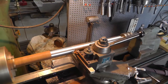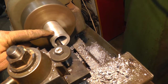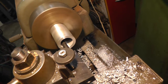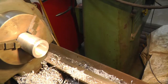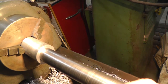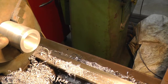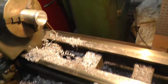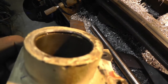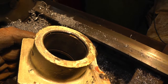I started turning that shaft down. I'm making the bushing for the casting — got the outside part turned down so it fits the casting, taking the last pass on the inside. We'll give it a try and see how she fits. It will be just about right. Now I've got to part it off and figure out how thick it's got to be. In this casting it's going to go right in there, and you can see there's a snap ring groove where the bearing was, and there's another snap ring groove down in there further.